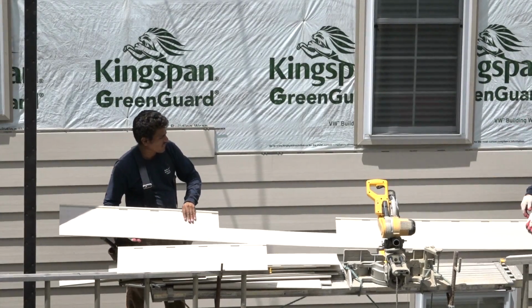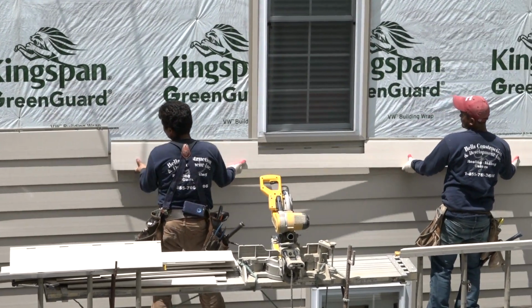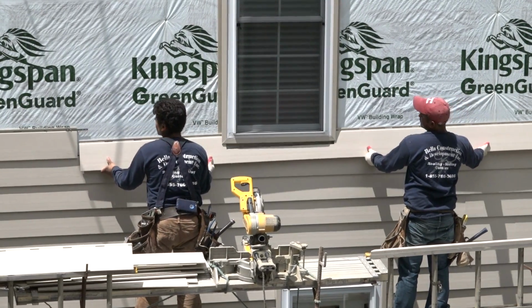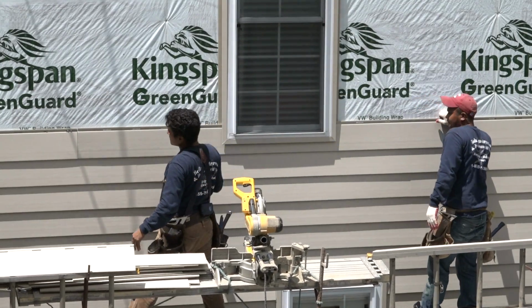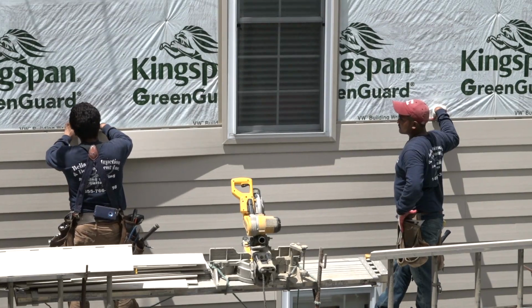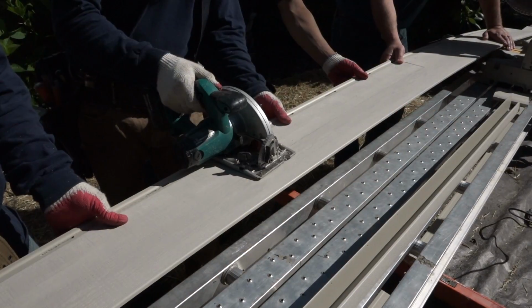Try to avoid seams under and over windows and over doors. Measure the width and depth of your required cut to fit under or over the opening. Keep in mind, planks must be able to move laterally 1/4 of an inch. Ensure that this space will also be provided for planks installed under windows and above doors.